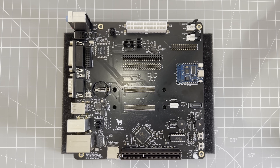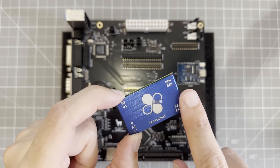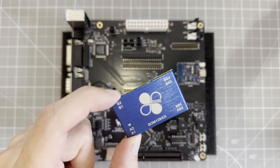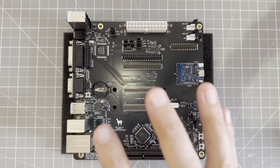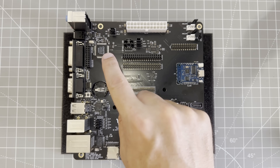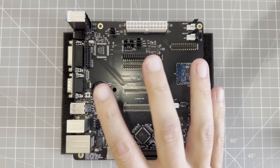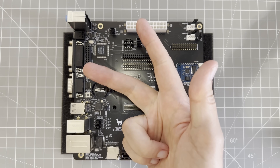The ITX Llama solves this issue with the Vortex 86 system on module. Hidden inside this module is the ability to expose the ISA bus via GPIO pins. With the help of a custom BIOS on the motherboard, the ITX Llama wires the Vortex pins up to a Crystal CS4237B, which is essentially an ISA Sound Blaster card on a chip, complete with FM synth, Sound Blaster audio, and MIDI.